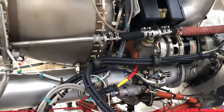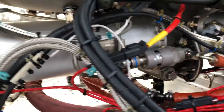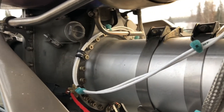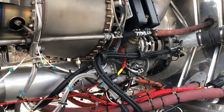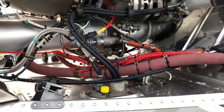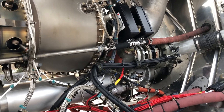We've got some more Tannis pads on the engine just to keep the engine oil warm that's actually sitting in the engine there, and they're all linked to the Tannis system. We've also got one on the back end of the engine on the other side — you can't quite see it — but that all helps to keep the engine nice and warm. If it gets really really cold, like minus 20 or minus 25, I'll actually go and stick another body heater on the engine deck to keep it nice and warm once the thermal covers are on. That's the Tannis system for the engine.